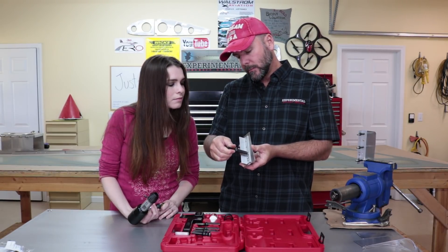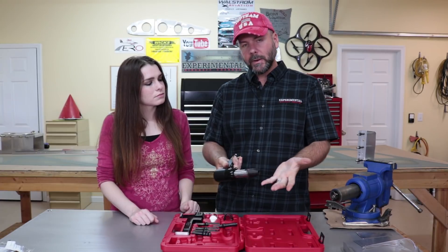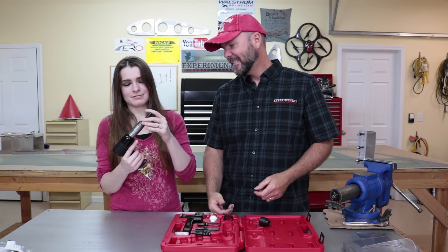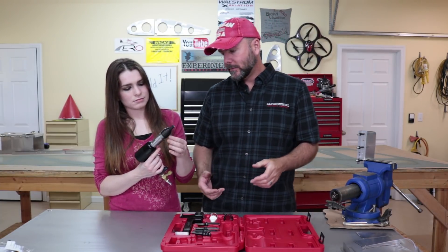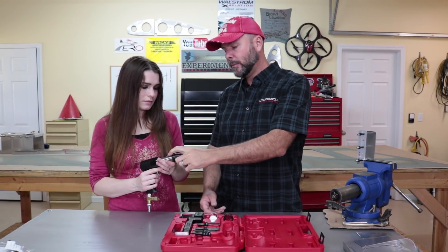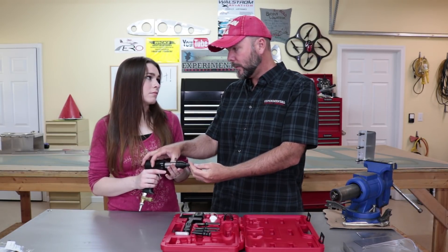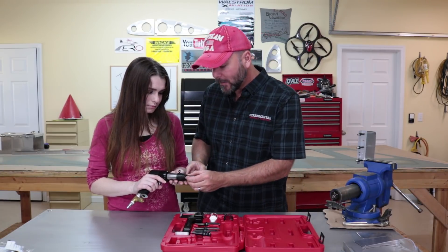Select the right fitting that covers the whole rivet head. To assemble: this little part sticks up — rotate it around and it comes off, then slide the fitting in. Once locked and loaded, the spring goes over. The spring acts like the threads of a nut. Hold the spring part itself — not the end — as you spin it all the way in until it bottoms out. It will still have a little bit of play. The gun itself is what does the hammering; the spring is really there to keep the fitting from flying across the room.